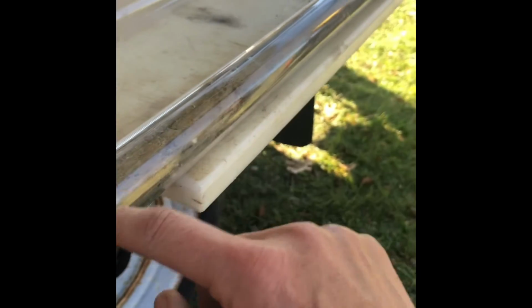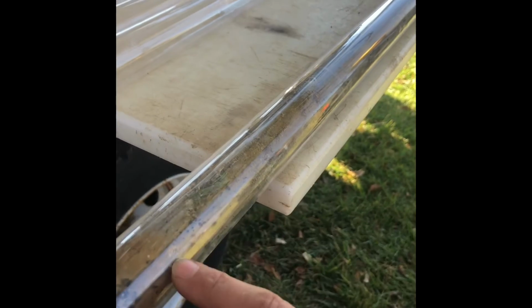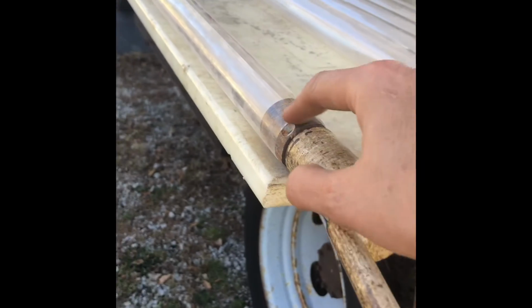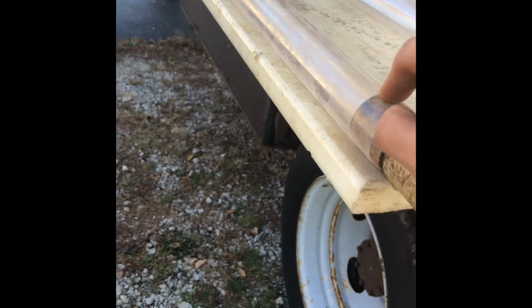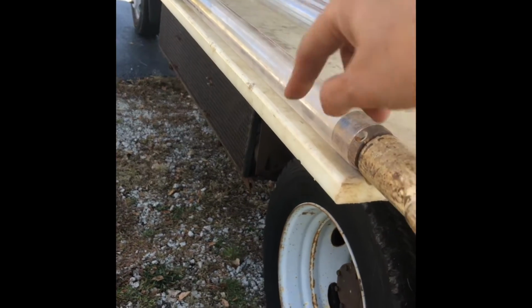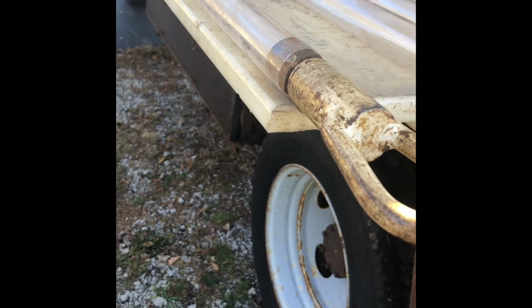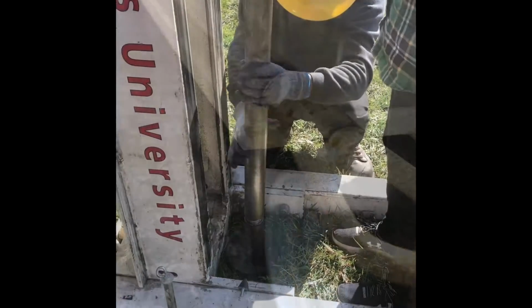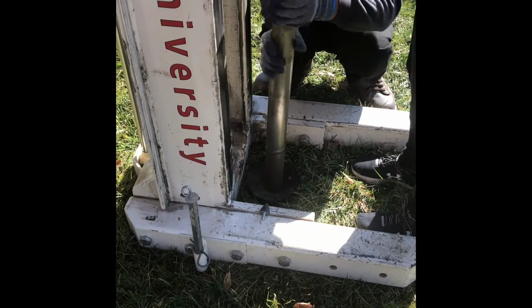So you're going to label this 0 to 4 feet. Whatever site our supervisor is calling this site, today's date, and you're going to put duct tape on this end, and then on this end, you're going to take off this metal piece right here, and then you're going to put duct tape on this end. You always know the base of it has got that core catcher, and the top has this hole on the top, so you know which way is up, or you can label which one is up, so you don't get them back. So for the next 4 feet, you put that on.